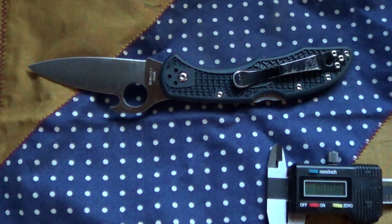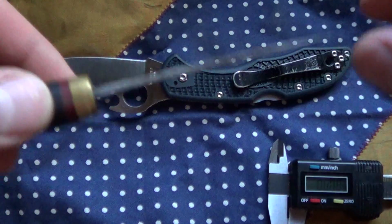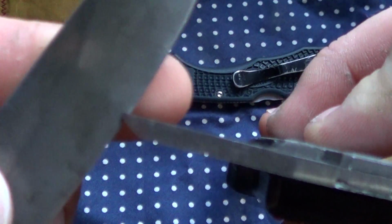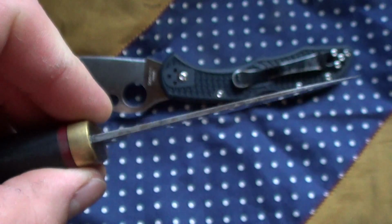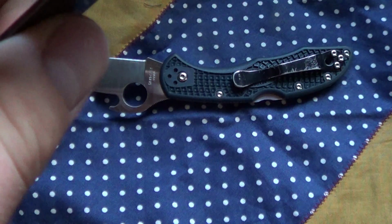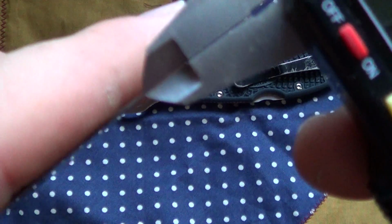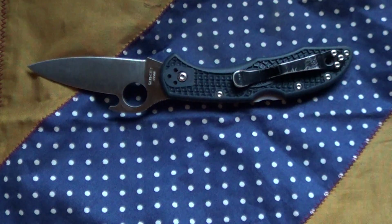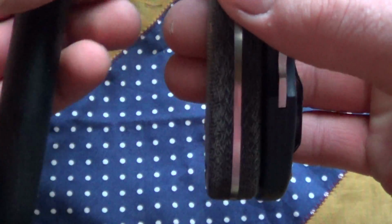Actually, the Phil Wilson isn't the most extreme knife that I have, though. That'd be this one from Joe Calton. I think I'm pronouncing his last name right. This one is about the same as the Phil Wilson. I mean, you can see it sits a little higher, probably. It's more just the stock thickness. And it goes down to like a needle. I don't even know the thickness. 2 or 3 thousandths thick, maybe. You can see how much the calipers come up on the tip. Anyway, so yeah, the stock thickness is, he put a nice tapered grind on the Delica 4.